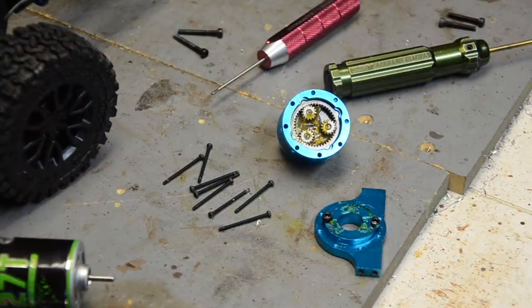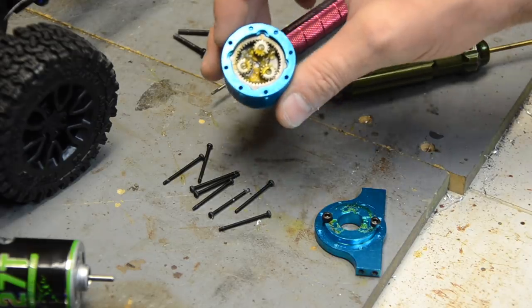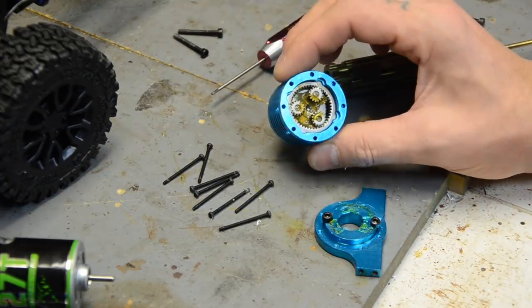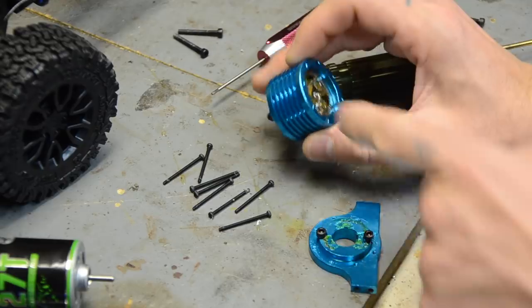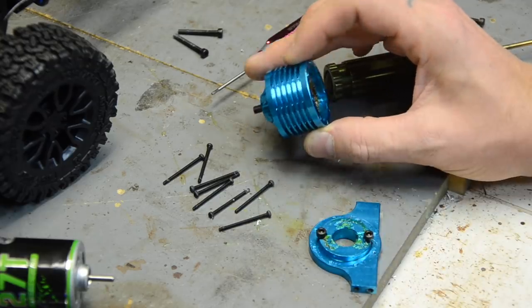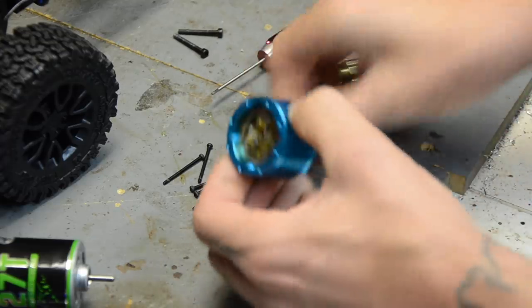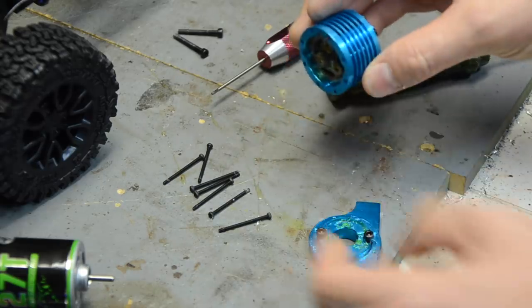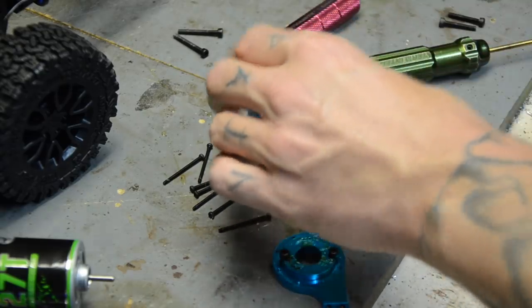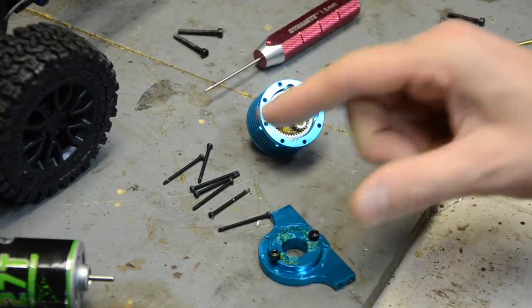So this gearbox, this thing is very involved to take apart. Inside it looks like a version of their, what was that one, the Disruptor transmission, or I can't remember what they called it. It's one they used to have back in the day. Different front housing. They had a mini version. The gears were close to that size. Same layout, different casing. We've got ribbing. I don't know if this is really going to get that hot. I guess it could. But all of these little, long, skinny screws go through and attach to our plate. So you have to take that apart to get the motor on, and to get to some of the screws with any size wrench, basically you've got to take the entire motor plate out.